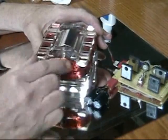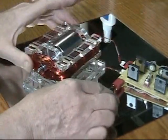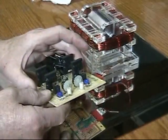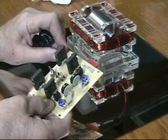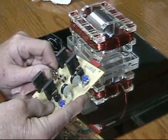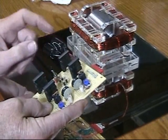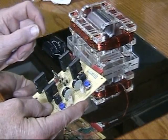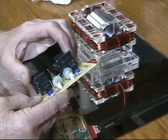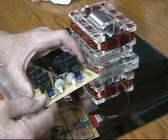There's a balance slot that's cut in the front of the rotor, and I've got a couple little pieces of solder in there. The circuit, as I mentioned, is a sequential bipolar Bedini circuit. I'm using some radio control connectors for RC airplanes — these are Dean's Ultra connectors. The transistors are MJ-21194s and 193s, which is typical of the Bedini stuff.